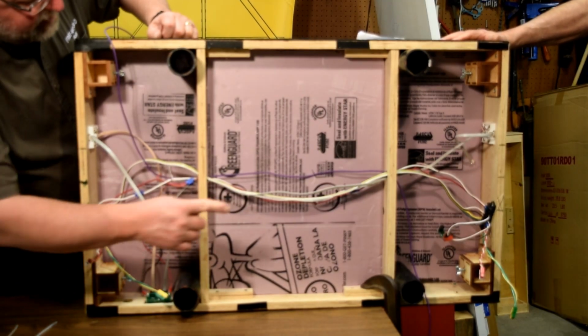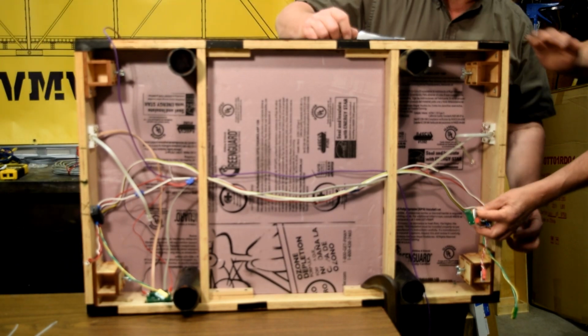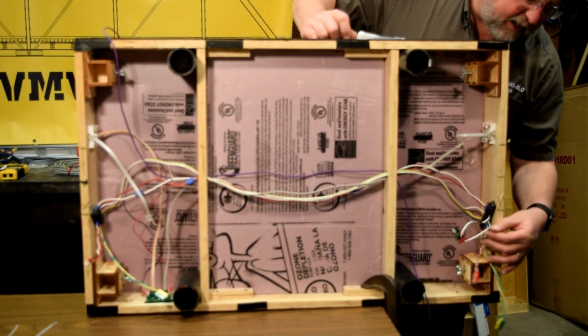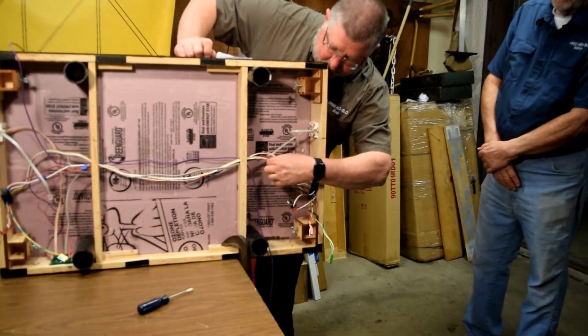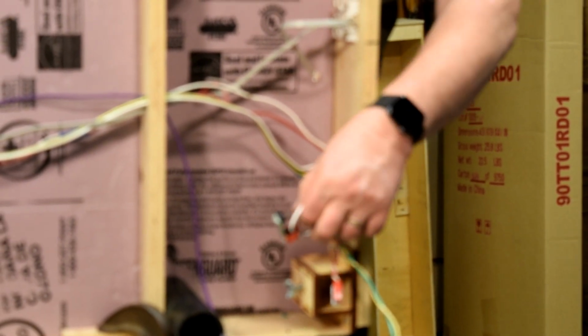Okay, so we've now added at this end our BD20. You'll notice that it's connected between the pigtail, which is connected to the bus wires, and the localized isolated bus, that's our detection bus. And it's one wire that goes through the BD20. You need to be careful.